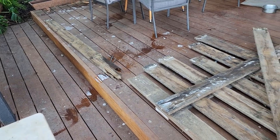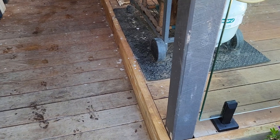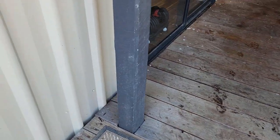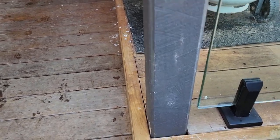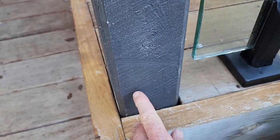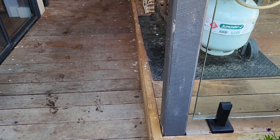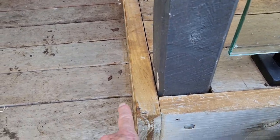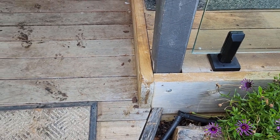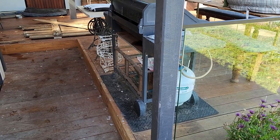It's really hard to keep things neat and clean so this will be the gate project I'll be getting started on today. I'm thinking I'll hinge it off this post, mainly because this post is actually out from the wall. It won't matter if the gate hinges back into the garden area. I'm going to use hinges that just have a peg out and up, and another one at the top, so the gate will have just a loop that sits over it so I can actually lift the gate off if I want to. We'll probably go up to the same height as the glass paneling.